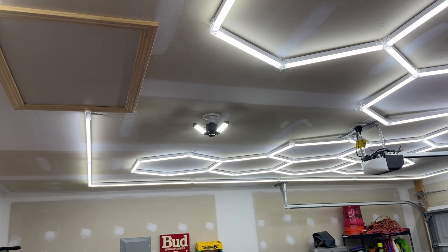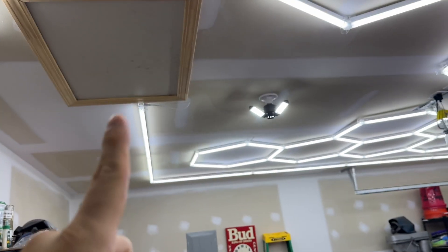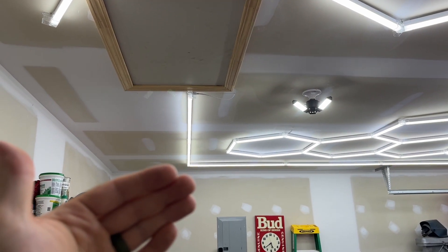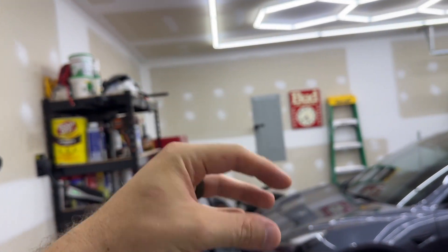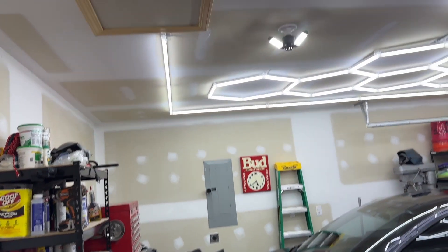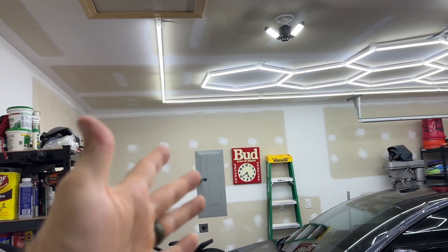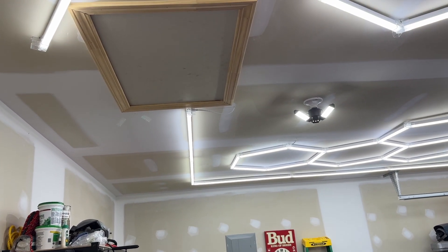Summertime, it's just the tar, the shingles, everything - it gets crazy hot up there. So what I've ordered and what I'm going to put up is a radiant barrier. That radiant barrier is something you put up - it's like tinfoil, but it stops radiant waves that come in from the sun. It's basically a barrier for that heat to seep through into your attic. And once it's in your attic, it slowly seeps into your house, garage, whatever. So I'm going to put it up - let's go up there and see how crazy hot it is.